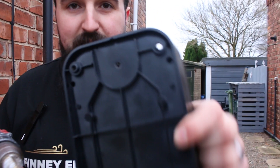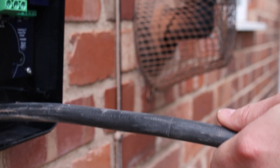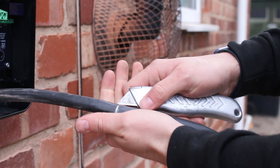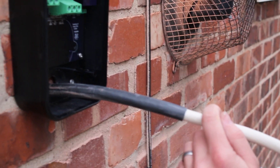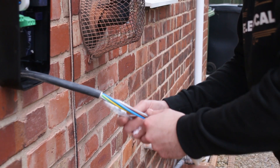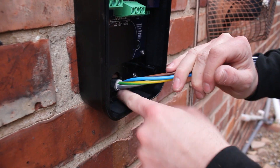I'm just going to drill a little entry hole in the back so you don't see any cables. Then we'll get him stripped - score around like that, come around the other side, and slice down. Let's just unwrap the banana, then push the excess through and wire up into the mains-in on the left. We'll push the excess back through and get that gunned off later to seal it up nicely.